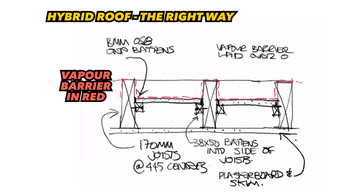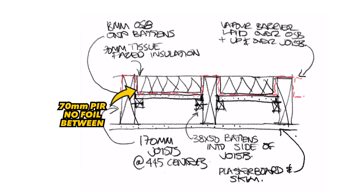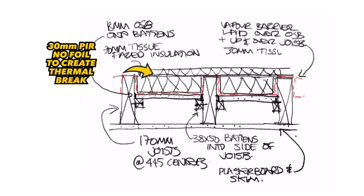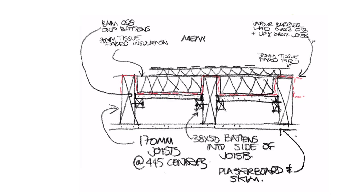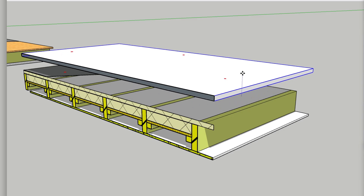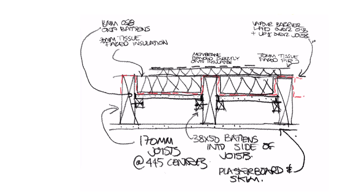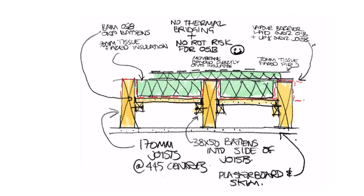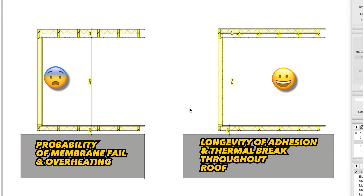We tape the vapor barrier into our wall vapor barrier. Then instead of putting the full 100 millimeters of insulation between the rafters — 100mm being what a lot of other builders suggest — we're going to split that: 70 millimeters between the joists and a further 30 millimeters over the top, using plastic sleeve washers to stop any thermal transfer through the screws which need to go through the insulation and into the joist. 30 millimeters of PIR is about the minimum where you start to avoid cold bridging and thermal transfer through the joists. Because we eliminated the need for the timber deck over the joists, we've saved ourselves 18 millimeters of height — ending up just 12 millimeters higher than the other solution — but we've avoided a rotting roof deck and substantially reduced thermal bridging to keep the interior cool in summer.